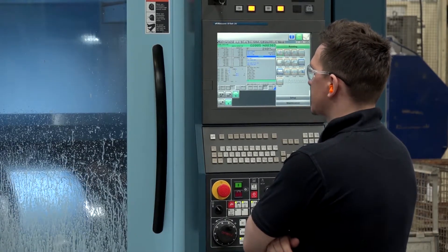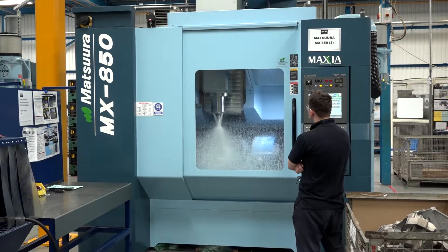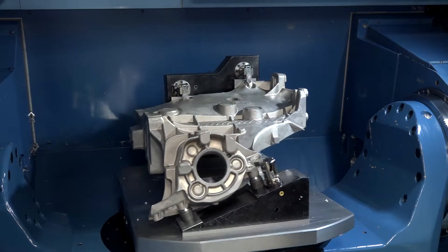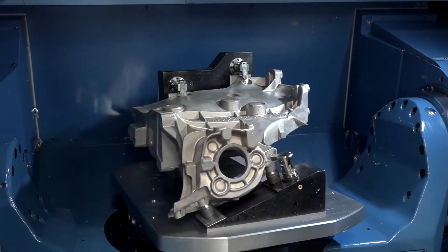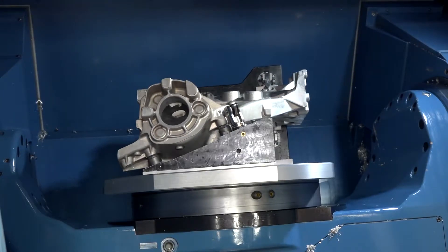When you have work holding like this and you talk about automation, you can't manually be clamping those castings on there — how does all that work? Well, it's all through table hydraulics. We're working in conjunction with other suppliers, people at FSC — it's all through table hydraulics, so the work holding is designed with them in mind. We work with them for not just their actual systems behind the machine, but also the clamping itself.